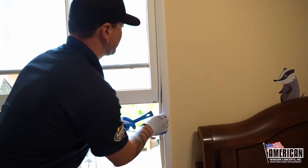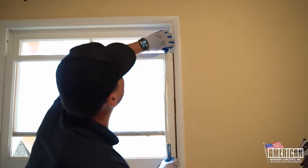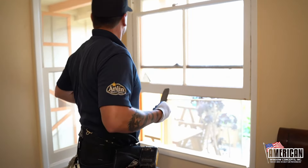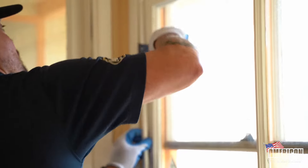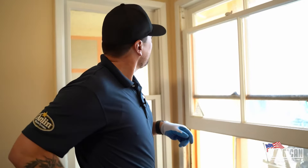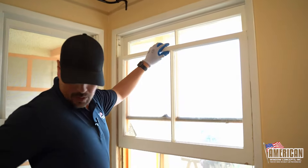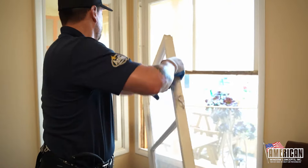You're going to get a little cracking and breaking, and that's quite all right. We're going to do the same thing to the other side. Any little nails left behind, you're going to want to take either a hammer and hit them in or use pliers and pull them out. The window wants to wobble — pull this thing out.